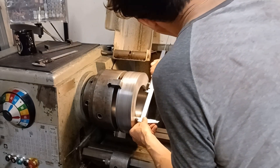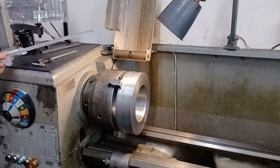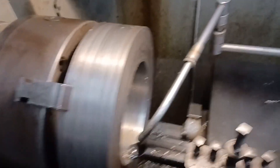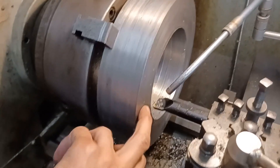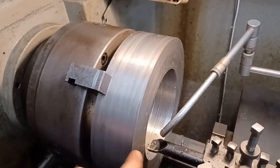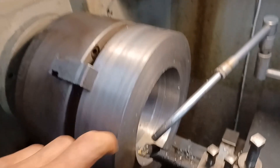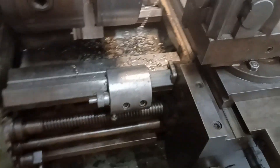I can't actually remember where I got to with this one — so that's a dimension, and I've got to start on the bore. I'm doing this slightly differently to how I did the other one. This is not to dimension yet. What I'm actually doing is turning the bore down to just ever so slightly more than dimension, which is 41.5, so I'm going to turn it to say 42. Then I'll finally just take the remaining bit off this surface here — that's easier because I can concentrate on getting a good surface finish and go up to a shoulder all in one neat pass. I've got a micrometer bed stop on there and the clutch set so it's almost fully automatic.